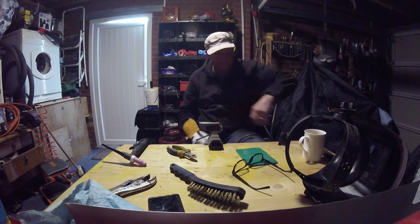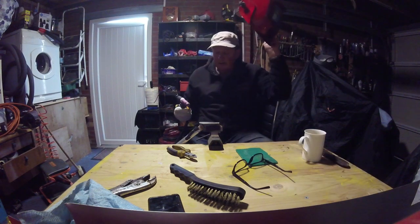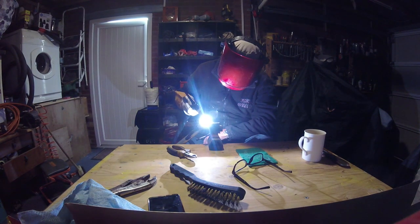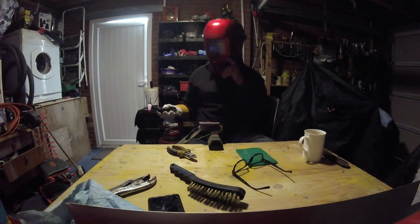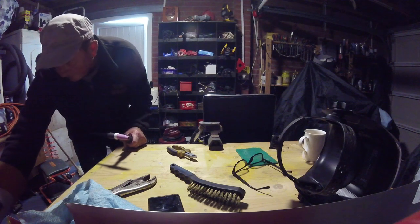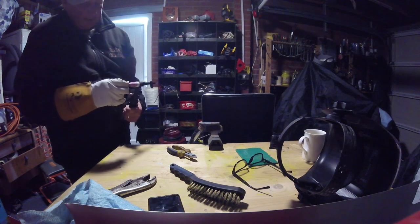Let's try another pass. I'll try it while I'm at it — I'll be holding some wire on them. That's all over the place. Maybe I dipped the tungsten. I'm just going to clean the tip up again. Like I say, I'm not sure this is going to be for me.